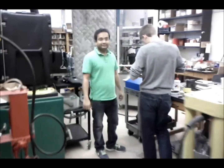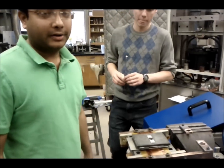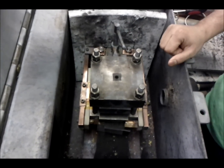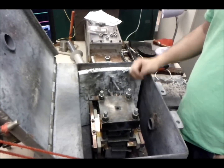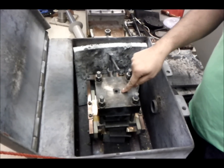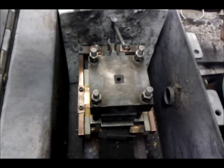We are on our way to the impulse metalworking lab. We are trying to weld stainless steel with aluminum here — a 304 grade stainless steel to be welded with 6061 aluminum in a T4 tempered condition. Here is our VFA setup connected to the terminals of the capacitor bank. This capacitor bank can charge up to 16 kilojoules, but we are going to use 8 kilojoules. While the flier is accelerating, we are also going to measure its velocity by looking at the flier through a hole drilled into the VFA setup, through a PDV probe.